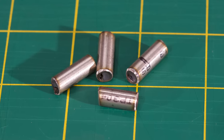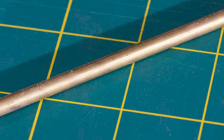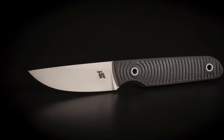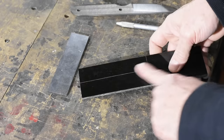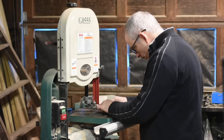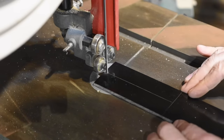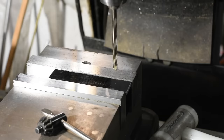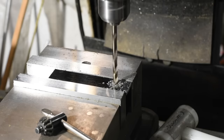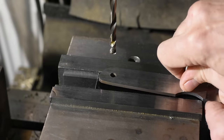In this case, I'll be using tube rivets, which are basically just stainless steel tube that I'll flare at the end to lock everything together with. Here I'm starting with one of my Tactics Armory blades, the Shadow model. The tang — that's the handle part — is absolutely dead flat, so that anything that mates to it needs to be dead flat too, and then everything will fit together correctly with no gaps. For the handle slabs, I'm using canvas micarta cut to size from large sheets. Then I'll drill the holes in succession to exactly fit the ones on the Shadow, using a pin to orient them and make sure the holes line up.